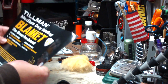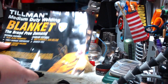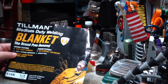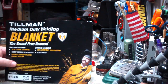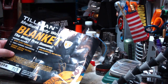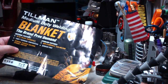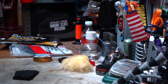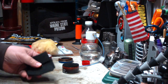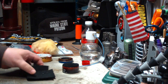Then on somebody's video I found out about Tillman medium duty welding blankets. This is a 3-foot by 3-foot piece and it cost me $22.95 — I'll give you a link below of where I buy them. It says it's non-flammable, non-melting, and has a working temperature of 1,100 degrees Fahrenheit. With all the stuff I've been burning, burning it down until it goes out, this stuff has never melted — not once yet. Five, six, ten tests and it's still in the same shape as it was to begin with.